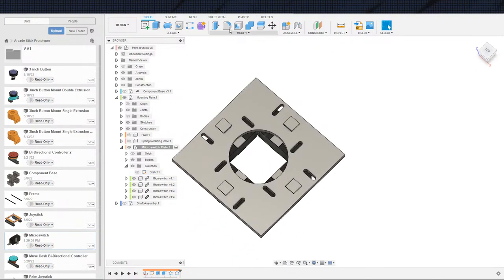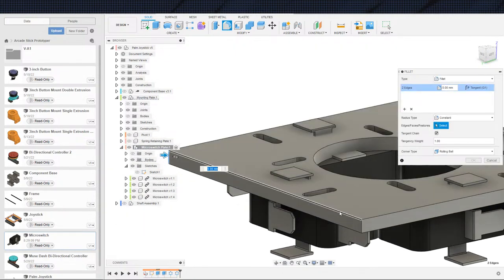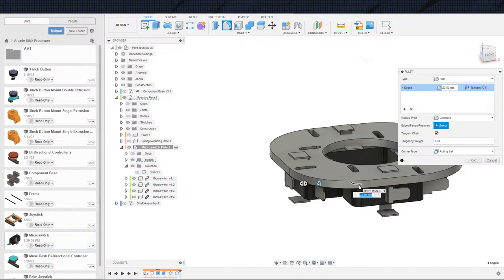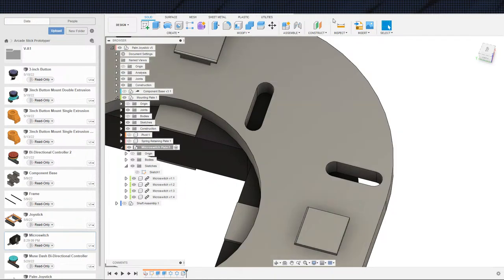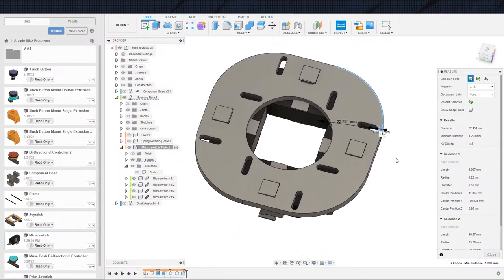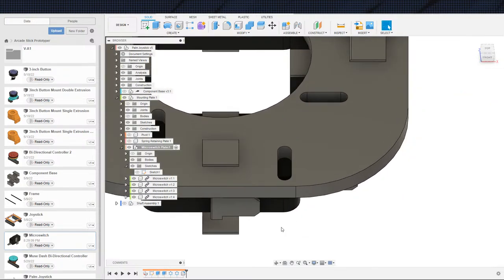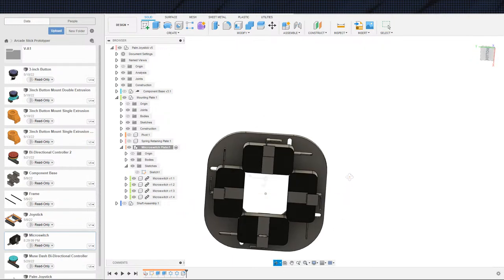So now I'm just going to fillet these corners just to make it a little bit nicer. And we will basically be pretty close to done. Yeah, 25. What's 25 look like? Good. What's minimum distance here? Just because that did suck in my minimum distance. Minimum distance 1.25. All right, we'll back you up a little bit. 23. Just try to get past this corner. 20. All right, cool. So that's the plate these micro switches will be on. Good deal.